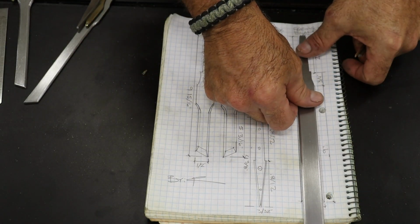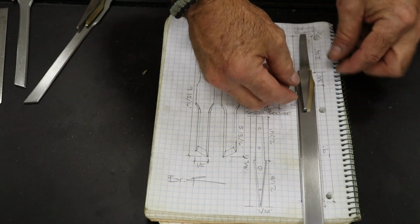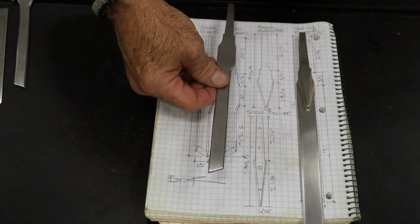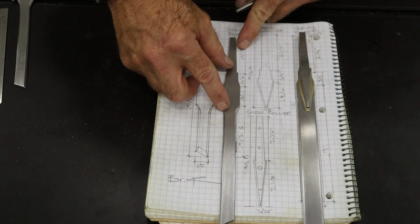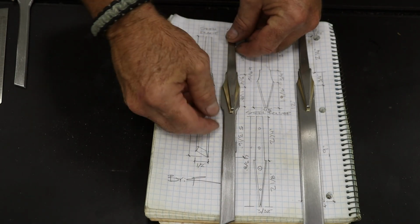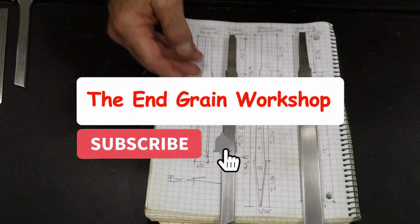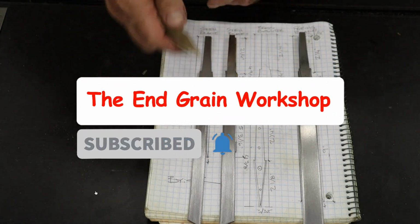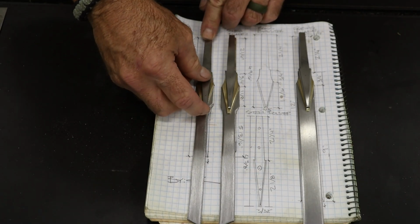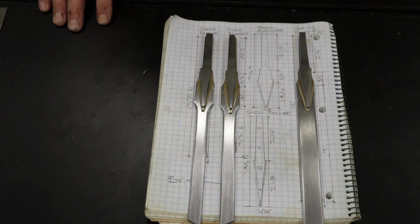At this point, you should have a completed paring chisel blade and 2 skew chisel blades, each with those opposing angles we talked about earlier. And now you can really see how, depending on which side you file the top bevel, you can either mirror the tips or give each one a different haircut. It's chisel styling at its finest. The only thing left to do on the blades is grind the rough bevels. We're almost there. On the bolster front, we've got 3 completed brass bolsters and 3 steel bolsters all ready to go. It's starting to look like something now, and it's not just a pile of shiny metal parts anymore.